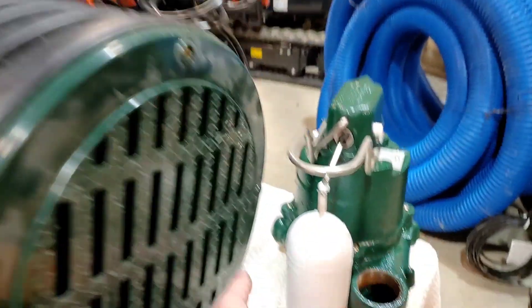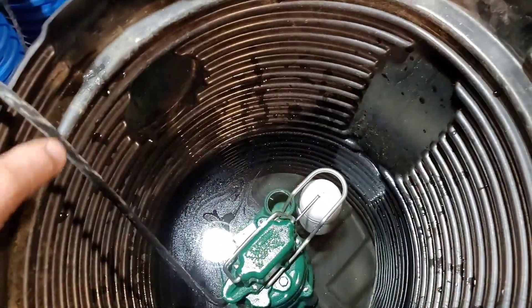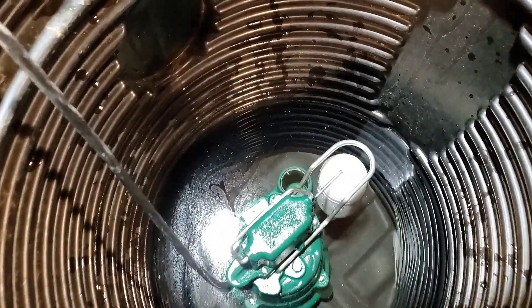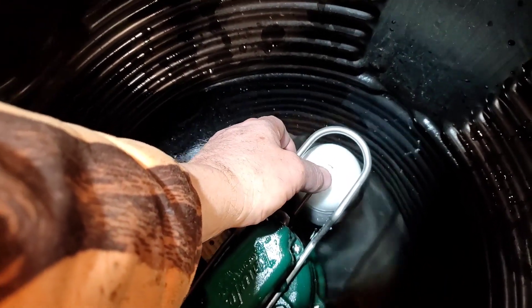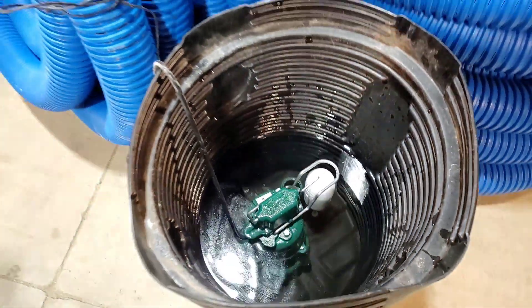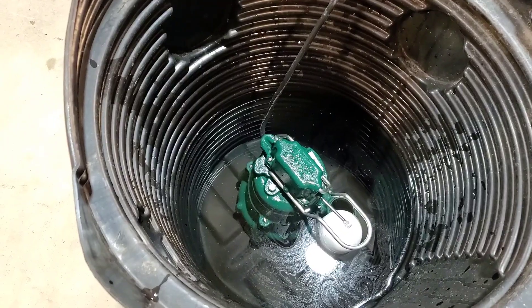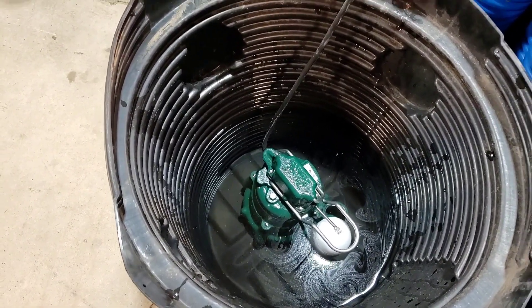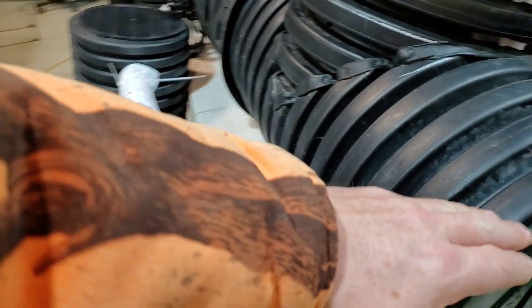When the primary pump falls behind, the secondary pump kicks on, and we're not going to wear out the switches on the pumps — because that's what wears them out. In my career of 35 years, 99 out of 100 failed sump pumps failed at the switch. They're too grimy, too nasty, and it's not cost effective to rebuild them, so you have to purchase a new sump pump.